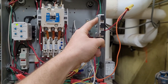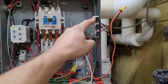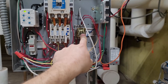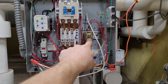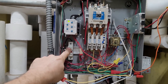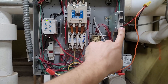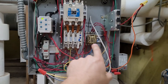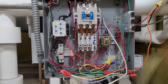From the auto terminal it can be connected with the common terminal — anytime the auto button is depressed it will be connected with the common terminal. The common terminal comes down to the relay which will move the ISO valve and enable the pump. The hand function also gets 120 volts constant from the fuse, so if you press hand, hand will be connected with common, and common is connected with the relay — it enables the pump and the ISO valve even if the chiller is not running.